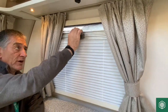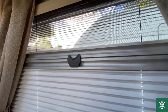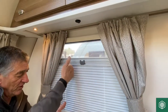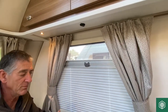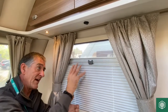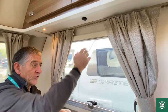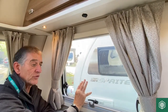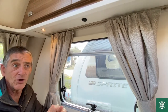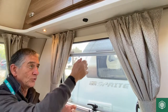In storage, I ask all clients to make sure they have a ventilated gap at the top, because we've got a lot of strong sunlight over a long period of time reflecting against this mirrored or silvered blind. It's reflecting that heat back against the perspex window, and what that will do is cause the inner pane to distort — unless you've got the fly screen slightly down at the same time, in which case any excess heat can come through the top and ventilate accordingly.